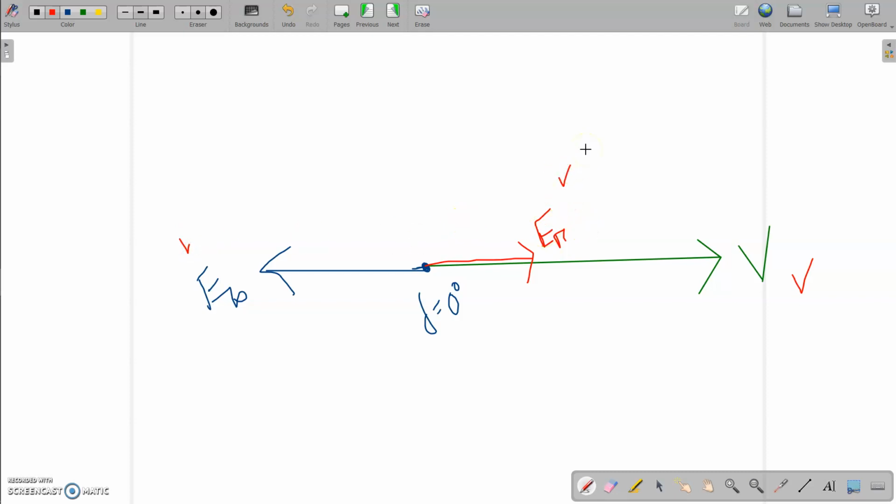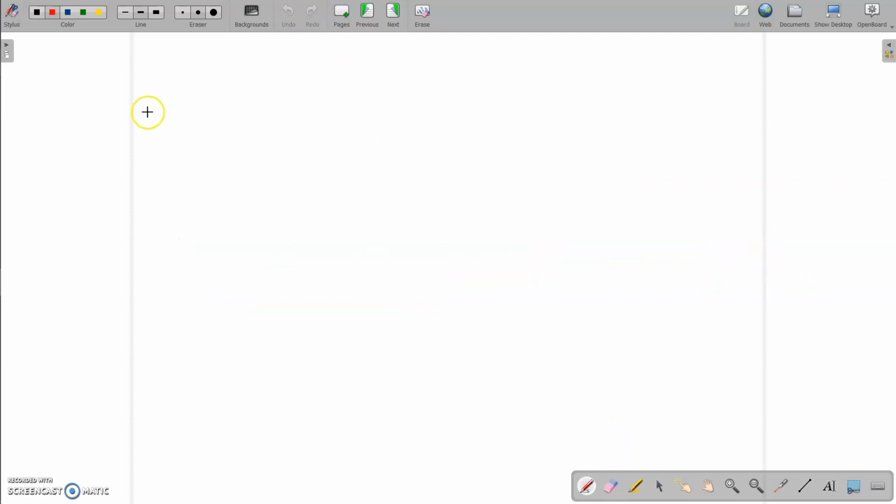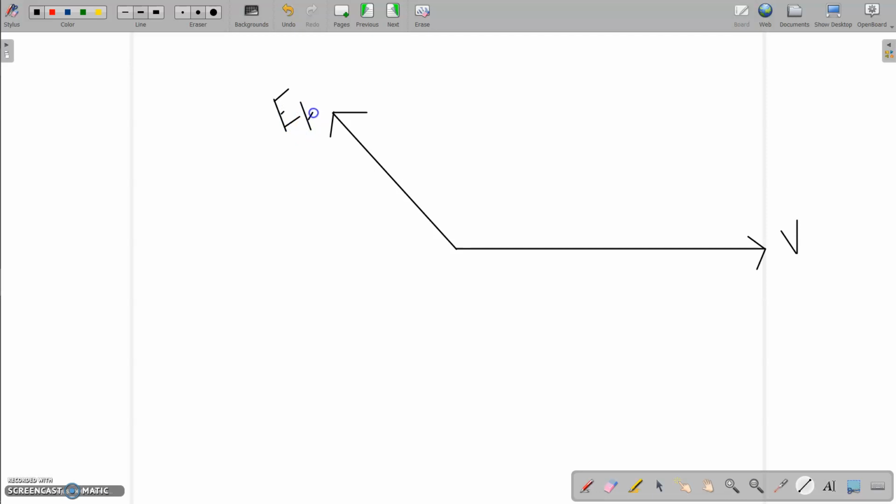So what will happen in the loaded condition? First, this is your V. In case of load, the Eb will be something like this. Now, if you remember from your HSC, we can draw the vector summation between these two, a parallelogram, and this line here is your ER, that is your resultant EMF.